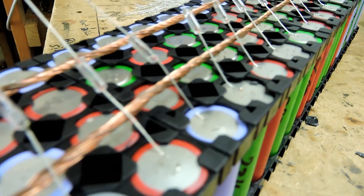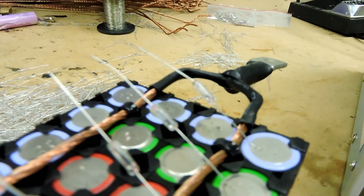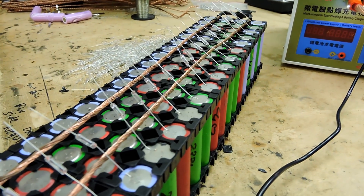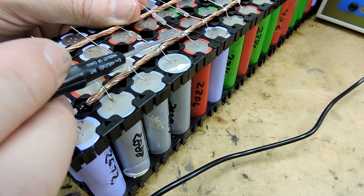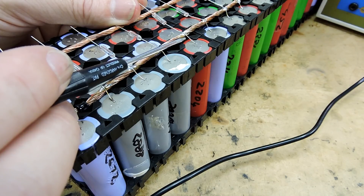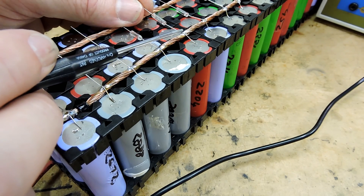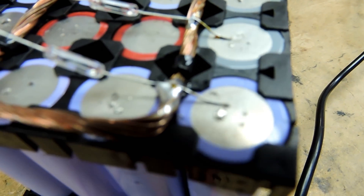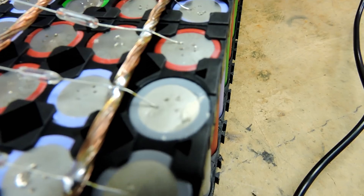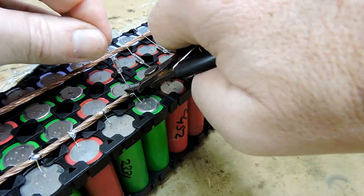There we go — there's the first 20 spot welded on. About six minutes to do 20 of them, and I think as I get better it's going to be much quicker. I've had two pop off so far — again, maybe that's technique. The plan is to use part of a fuse as the wire on the negative side. I should be able to snip it off here — as you can see it's a lovely nice tidy solder joint on the bus bar along with a nice safe spot weld to the actual cell itself. I think that's a win.